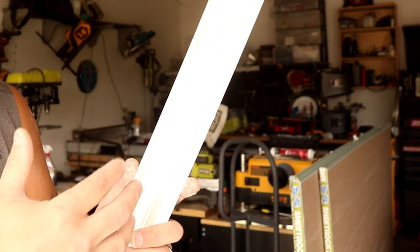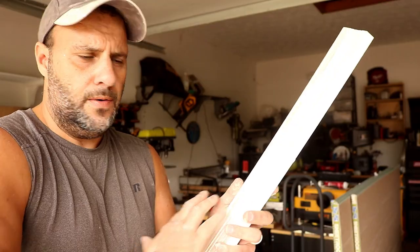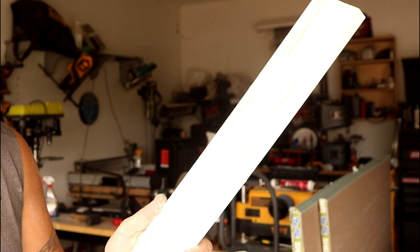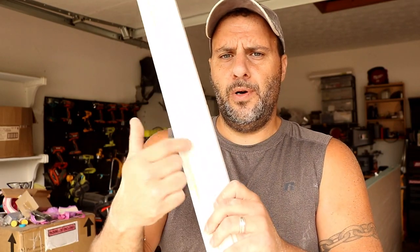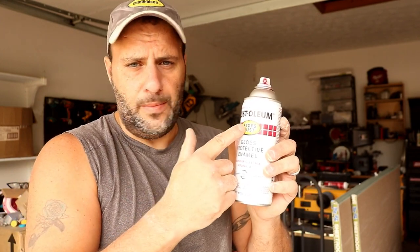Right here we have a piece of molding. Usually when you buy molding or a pre-hung door, they're always primed. So you scuff those down — get your sandpaper, a light grit sanding pad, 120 or 150 — and just take that surface down a little bit. Get it nice and smooth. Once you do that, it's ready to spray and it's going to be real nice by the time we're done with it. This one right here is already white; we're going to put red on the back so you can really see how it stands out and get that nice glossy finish. We're using Rust-Oleum — not sponsored.